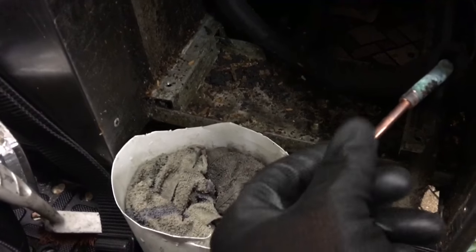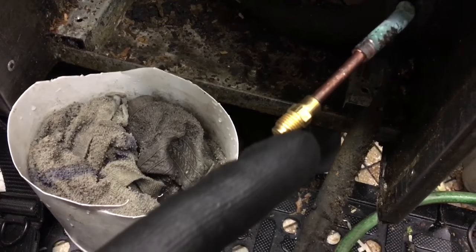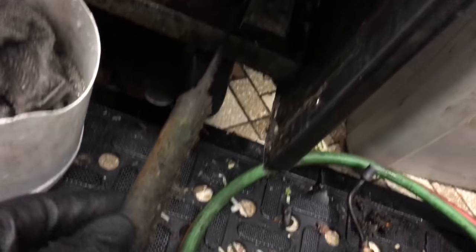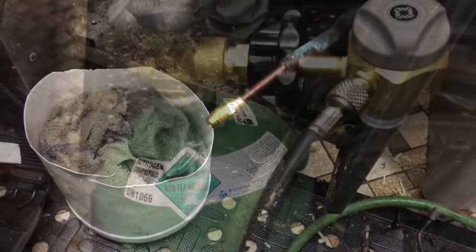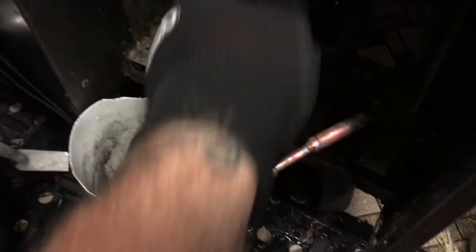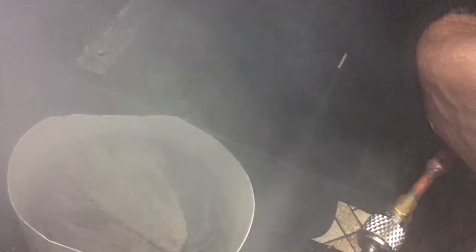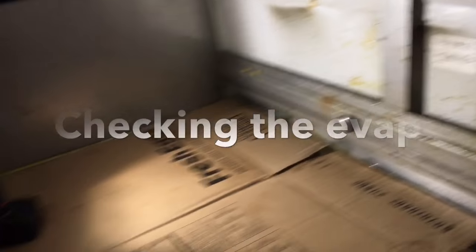What I'm going to do now is just take an access fitting into the suction line — I'm going to weld it in temporarily so I can get my nitrogen on and back-blow the cap tube. I still got the old dryer on the cap tube; we're going to cut that, then back-blow the cap tube and see what shape it's in. Nitro set up — let's crank it open. Did I get some crap out of there? Look at that — now we're blowing.